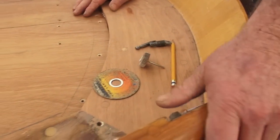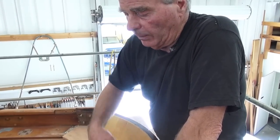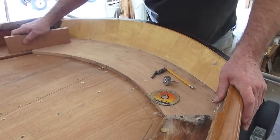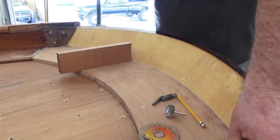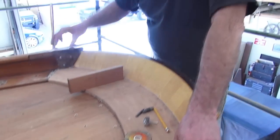And the stainless knee that Keith is going to cut down and have to refit — because the deck used to go like this back here, but now it's perfectly flat. What about our drain holes? The drain holes can go pretty much anywhere you want. As soon as we get this fit and we know where we can do it, that's where we're going to do it. Depending on how the boat sits in the water, it might be a good idea to put those drains in after you've been launched — see where it goes. You can use the hillbilly method: throw a quart of water back here and measure the deepest hole.